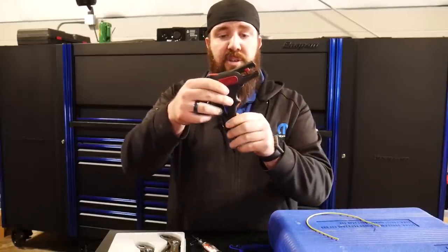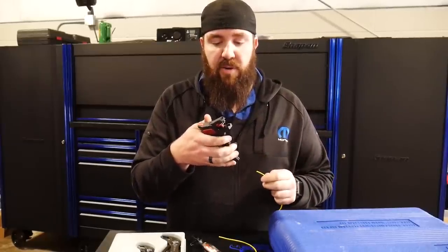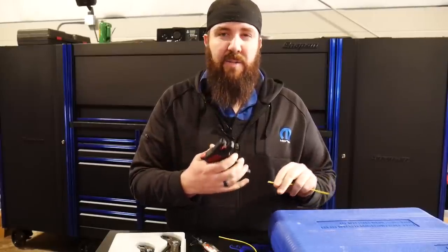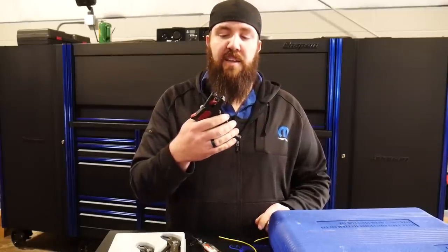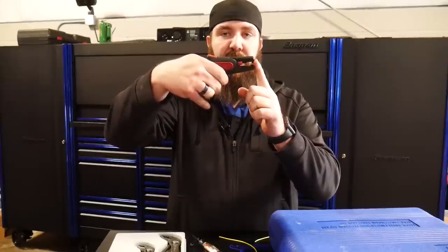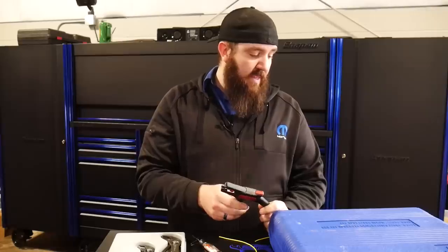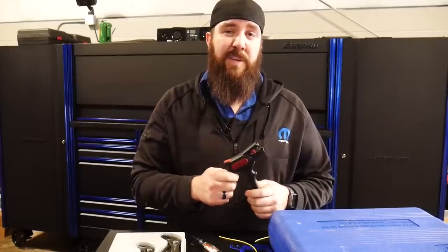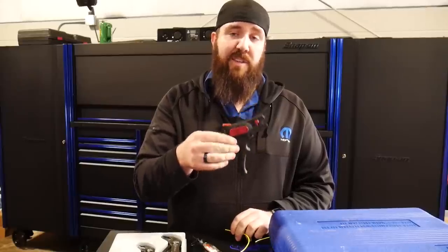Right in the hinge there's also a cutting tool. It can cut wire up to about 10 gauge, though I'd stick around 12 to 20 gauge for best results. It's auto-adjusting, so if you put something bigger in, it automatically sets for that size — the tension goes down until it hits the wire and strips it. The Bluepoint set runs at $42.75 through Snap-on. On Amazon they're a little cheaper at around $37.50. A great tool to have for wire stripping jobs and getting into tight places.